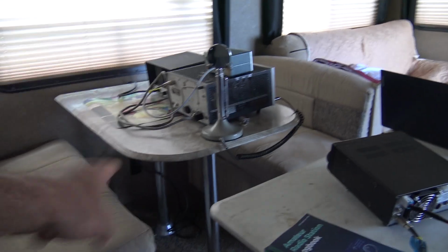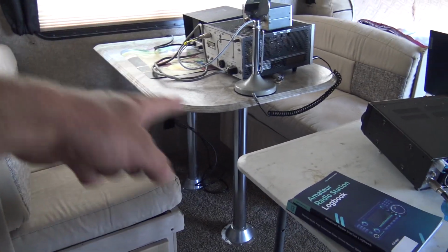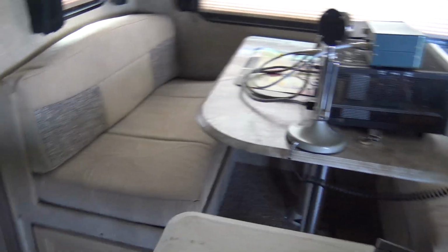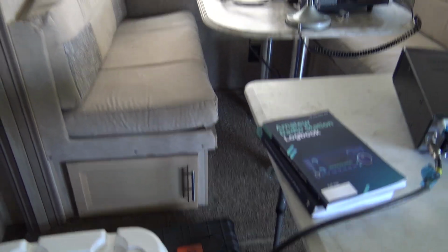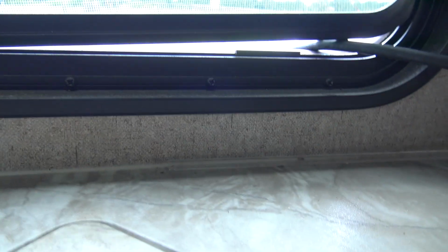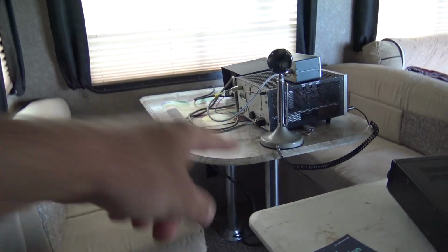I want to have outlets over here through the floor, and that way you can choose: do you want solar, generator, commercial power, or battery? That's what I'm going to do. I'm going to have all of them under there, there, and there. And then that way you can set up a radio here. Then I'm going to put bulkheads underneath the chairs that just basically pull up with the wood. And then I'm gonna have a bulkhead under there so I could have like five or six SO239s. You want to use your satellite tracker and sit inside, screw it there, and the cables are gonna come out underneath and go somewhere to the back or the front so that I don't have to do this. This bothers me. I don't like doing that. I did, but you get it. I want to go Ham Radio Concepts. I want to have bulkheads so that I could run solar, generator, battery, or commercial power, whatever you want.